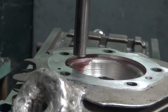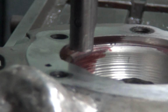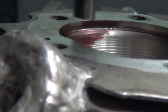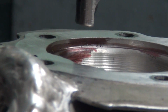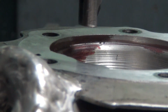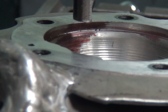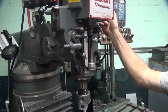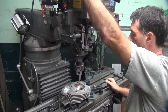All right, we got to touch this up without cutting anything because we don't want to cut any more metal. So the first thing we got to do is set our zero point. That'd be like down here. All right. So crank this down a little bit. Set our zero. Okay, we want to stop somewhere around there. See our stop up here. Adjusting our stop. See if we got a drag on it. See a drag. And we see where it really stops.